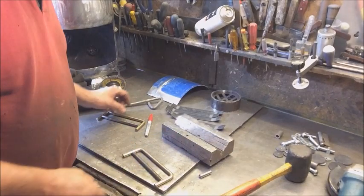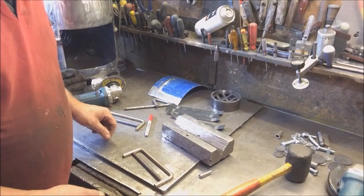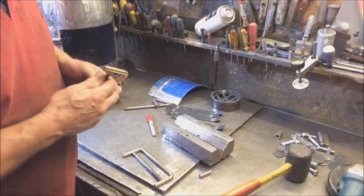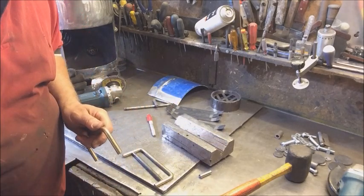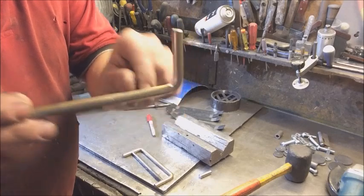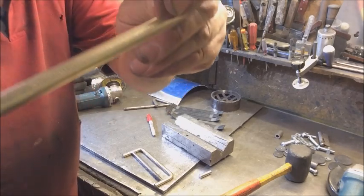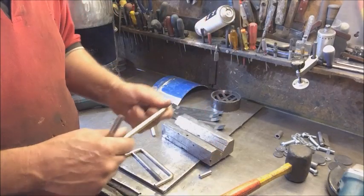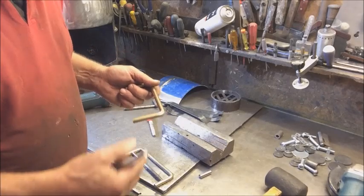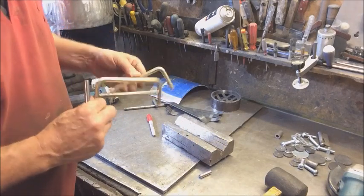Yeah, okay, so the last time I was talking, it's been a week since I played around with this. I had a look about and I decided to go for like a bed frame type of roof rack. What you saw me doing there was putting a tiny groove in the end. Okay, just normal round bar. I took an angle grinder, cutting this, not slitting this, put a little mark in each corner. That allowed me to put it in the vise, bend it round the same way that I did these, and then with a little bit of rubber persuasion I got two which were pretty much identical.